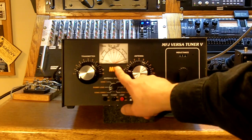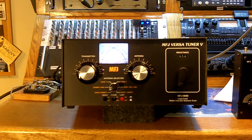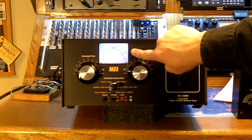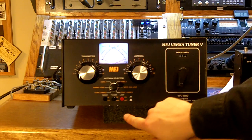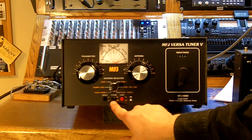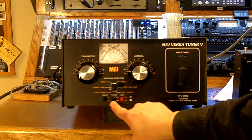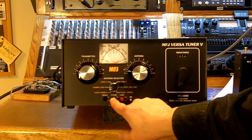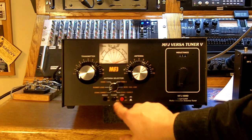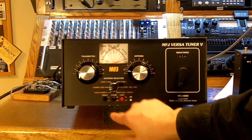There is a lamp in this unit. This camera likes to wash out meters with lamps behind them, especially this blue or whitish-blue type of LED lighting, so you might not see the meters well — I'll leave that off. There's a peak and an average switch here for your meter readings if you want to read peak power or average power. If you're in single sideband mode you might want to watch your peak output power; everything else will probably show up as an average reading.